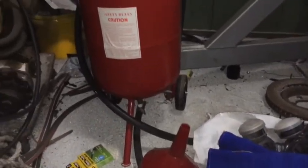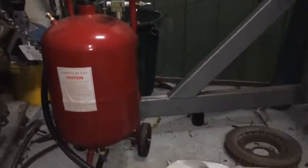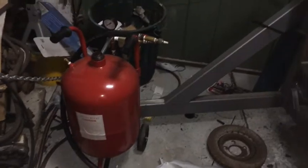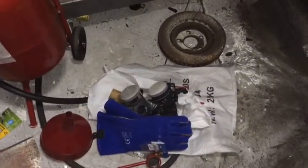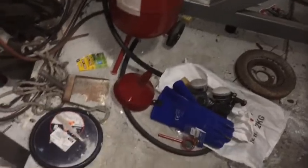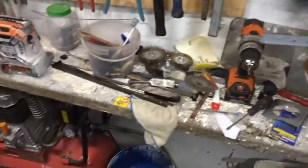That's the sandblaster I bought - cost me $150. Each bag of glass beads costs about $45 for 25 kilos. When you use it, make sure you use protective clothing because the sand gets everywhere - it will get in your eyes and your nose, and you don't want to breathe it. I wore a mask, a bonnet over the top of my head, and long gloves, and the sand still got into my face somehow. There's sand up on the top shelf - sand just everywhere. It makes a lot of mess but the end result you'll be happy with.